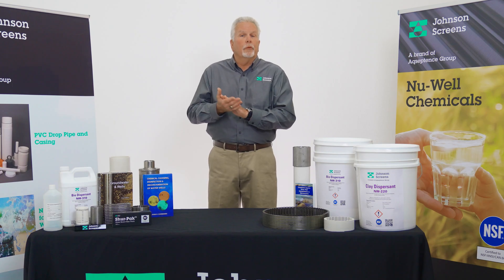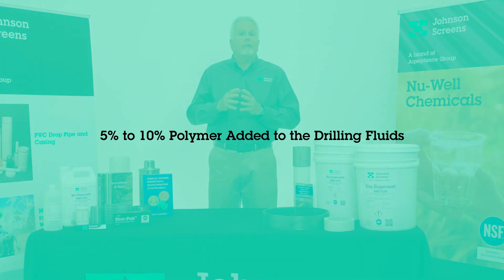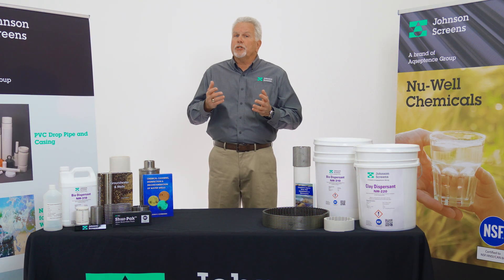Check with your drilling mud supplier to determine if any of the bentonite drilling fluids used in the drilling of your well was beneficiated or enhanced with polymers. Today most drilling fluids or drilling muds have five to ten percent polymer added to the drilling fluids to fortify the solution, yet their addition is rarely advertised or referenced as being present. If any polymers are present or suspected of being present during the initial drilling of the well, it is important that you treat specifically that polymer additive, breaking that polymer down first if you desire a complete and effectively developed well. The removal of this added polymer in the bentonite mud mix is critical to any successful well development process if the Newwell 220 or any competitive mud removal product is to work properly.